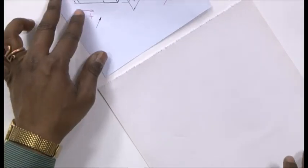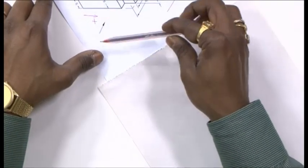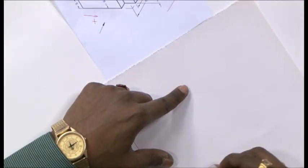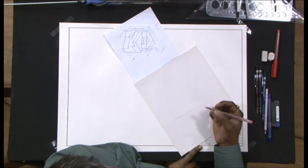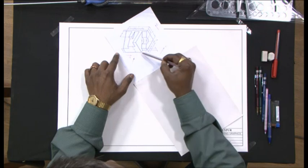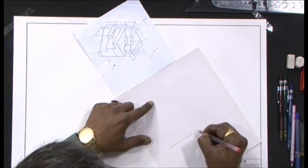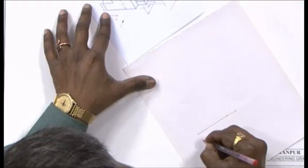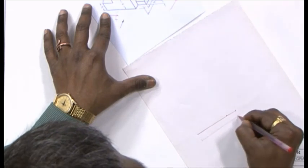Let me now start sketching the object — remember I am drawing this in the third angle orthographic projection. If I view the object along this direction, I will be seeing the bottom edge. Looking at the object in the frontal plane, I will see this line all the way through. This entire dimension from this point to this point is 90 millimeters — all numbers here are in millimeters. So this is 90.